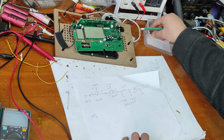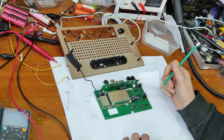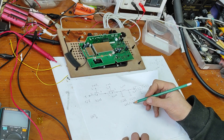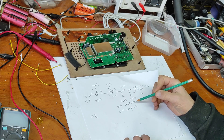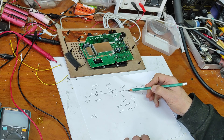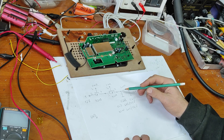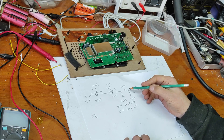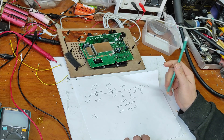The main problem is these two capacitors — initially they were 220 microfarads at 10 volts, but here we have 12 volts, and that's why the capacitors exploded. If you have a radio like this, please take it all apart and check these two capacitors. If they are 10 volts like the original, you have to replace them with 16 volts. I replaced the original capacitor with a 16 volt one, because 10 volts is too low when 12 volts is applied here. I measured the voltage and it's 12 volts, so it's mandatory to replace it with 16 volts — otherwise your device will also fail.